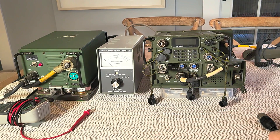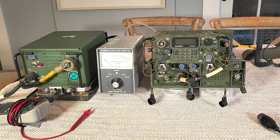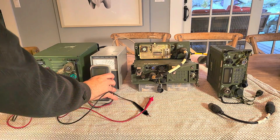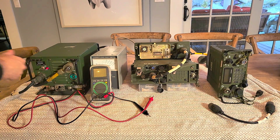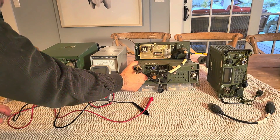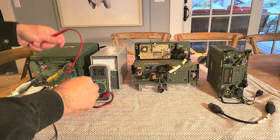No power. That's unfortunate — a bit of a bummer. Let me take off the radio and see if we're getting power through to the battery connection. Not exactly the outcome I was hoping for, but let's go further and figure out the problem. Let's turn on the power supply, make sure the circuit breaker on the mount is on, turn on the voltmeter, and start probing — we should be getting power.